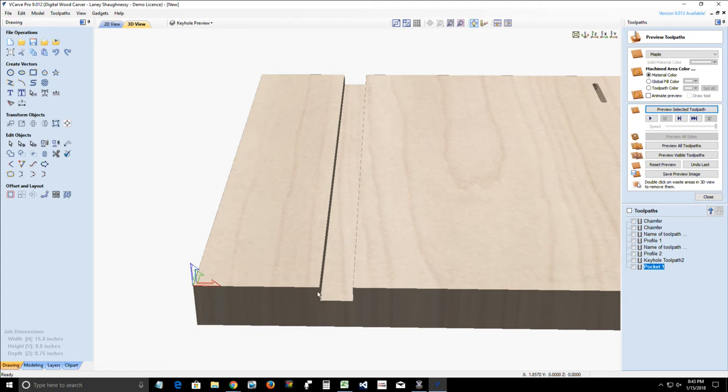Yeah, I know on paper it's showing a half inch here, but in reality, it was 7/16. So we need to figure out where you lost a 32nd of an inch on each side of the cut, because a 32nd and a 32nd equals a 16th of an inch, and that's what you're missing. You're shy a 16th of an inch on a half inch dado, on a 7/16 cut.